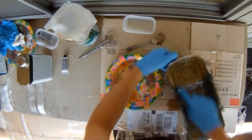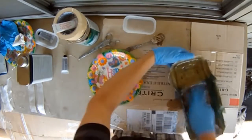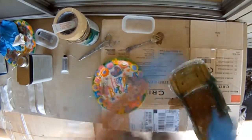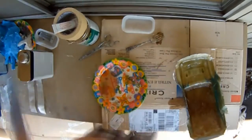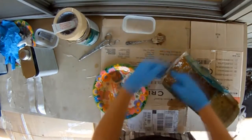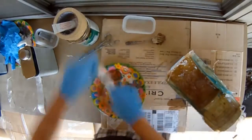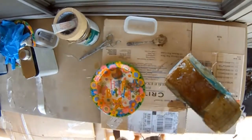Once you've completely covered it and let it dry for at least a half hour to an hour, depending on how much hardener you put in, you can either leave the fiberglass shell that you've created inside, or you can pry the plastic off and have a completely separate shell from the original plastic one. It's just kind of hard to separate the two once it's hardened, but it's possible.